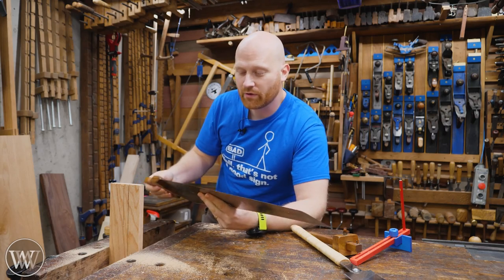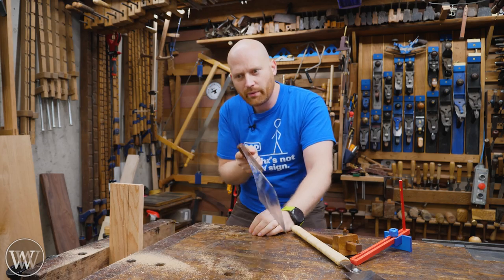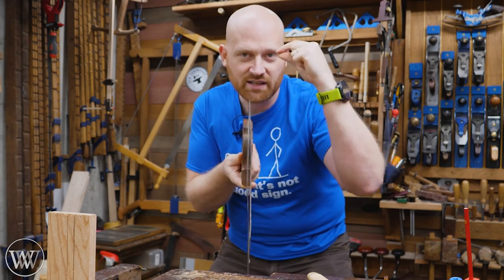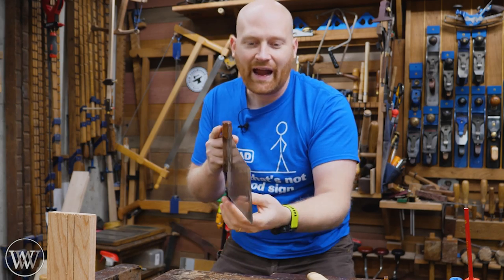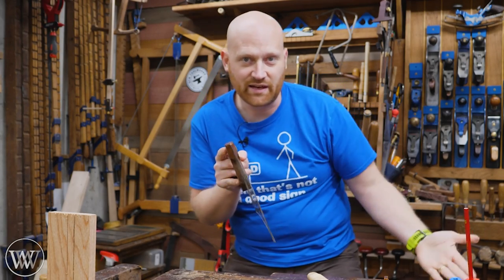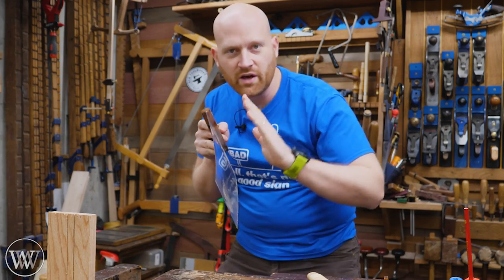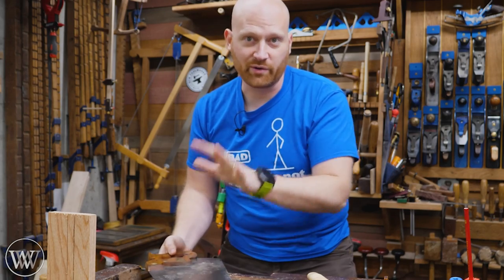However, this may be one of those rare times where the problem isn't yourself. If you see that you are perfectly in alignment and the saw is always going off course in the same direction, then the problem is probably the saw. Every tooth on this actually leans out to the side a little bit — that's called set. What that does is cut a bigger groove than the thickness of the plate, giving you the ability to twist and correct your cut. However, if one side has teeth sticking out too far, the saw will curve in the direction of those teeth. To fix it, you can stone it — just take a sharpening plate and run it down the side the saw is cutting toward. Two or three strokes and it actually cuts straight. I have a whole video going into a lot more detail on how to stone a saw.